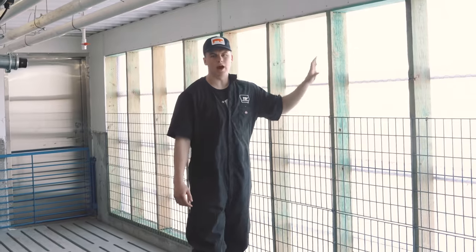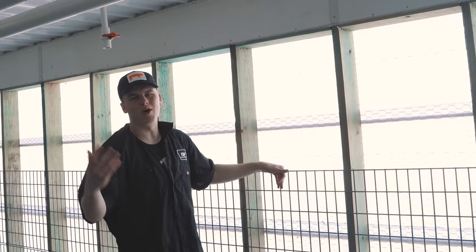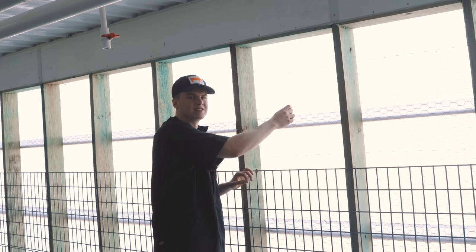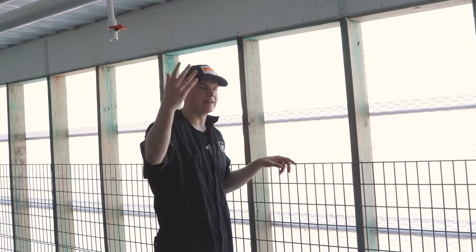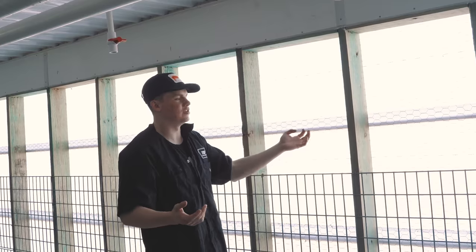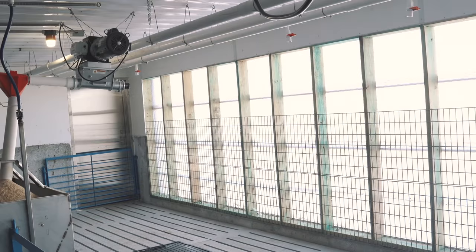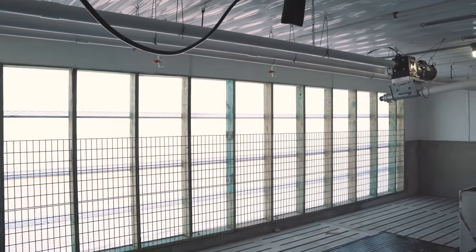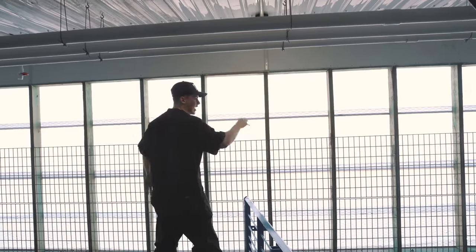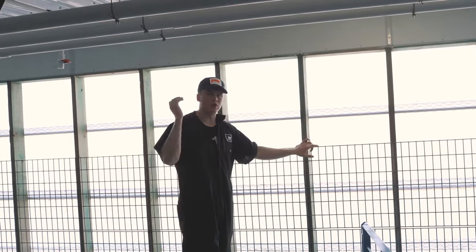We're down at the end wall where the tunnel curtain sits. This is the same design as my dad's solid-sided building. One thing that's a little nicer about this tunnel curtain is the bird wire is stainless steel, which will last a lot longer than the plastic-coated wire in my dad's barn. Most barns designed like this with solid sidewalls have a door right here, but we put the doors on the corners of the building. That eliminates splitting the curtain in two, giving us better even airflow and less maintenance with fewer curtain pockets to tend to.